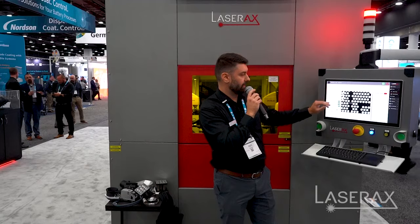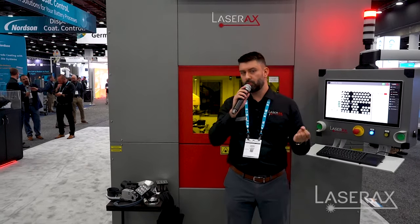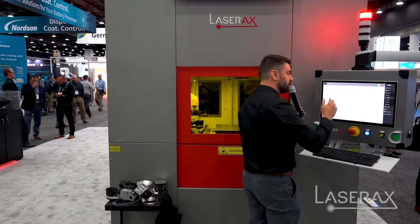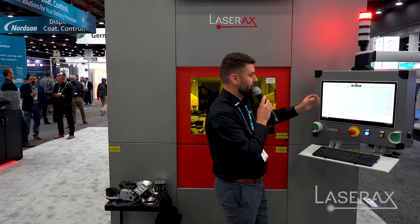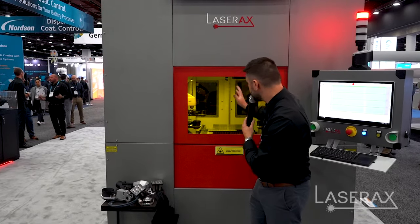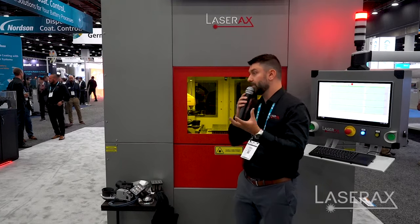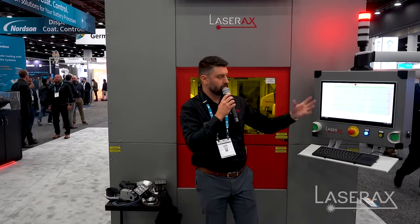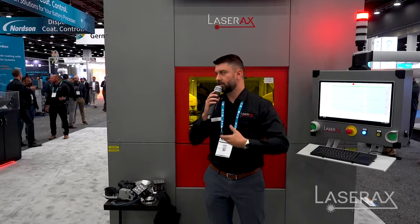Separately we monitor the negative and positive welds using a system from Precitec called the LWM — Laser Weld Monitoring. We've integrated this into the interface to make it efficient for development or ongoing tuning during operation by the engineering crew. That system looks at the light emitted back from the process during welding across three different wavelengths: plasma in the UV, temperature in the infrared, and back-reflection at the actual laser wavelength. After training and qualifying the system, it can detect bad welds caused by poor gap, contamination, or other defects.